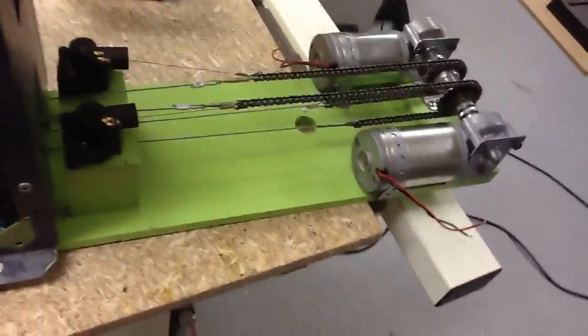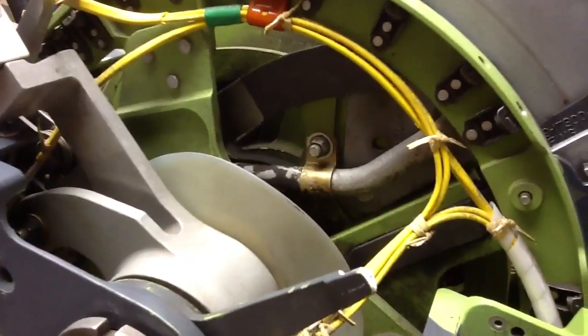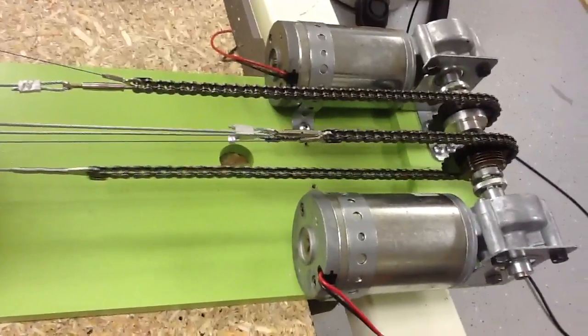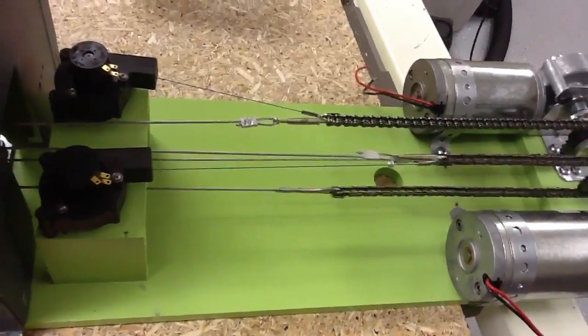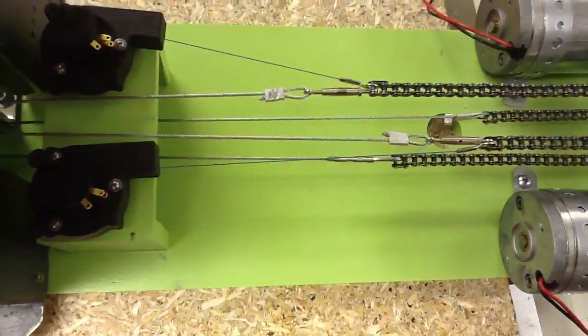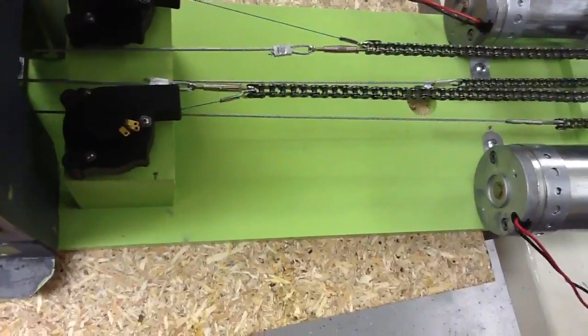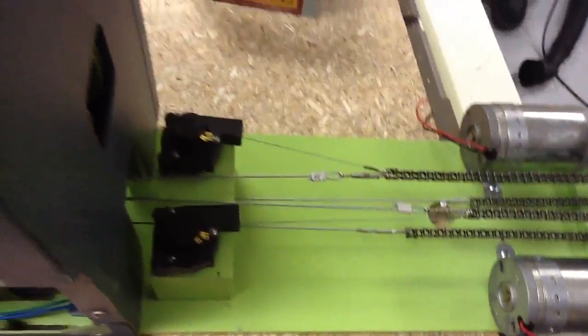I asked Rob how to do the thrust reverse. In a real throttle quadrant, when you get back and pull up the thrust reverse, you can see this pulley — I'll try to get a view of it. You'll see the pulley in there turn as I'm pulling up. What that does is move the cable even further, so you're basically getting the thrust reverse on the same pot, just like you would with a normal throttle quadrant you'd buy off the shelf. And that's a string pot right there — you can see it just goes in and out, all the way forward, all the way aft, thrust reversed. That's how that works.